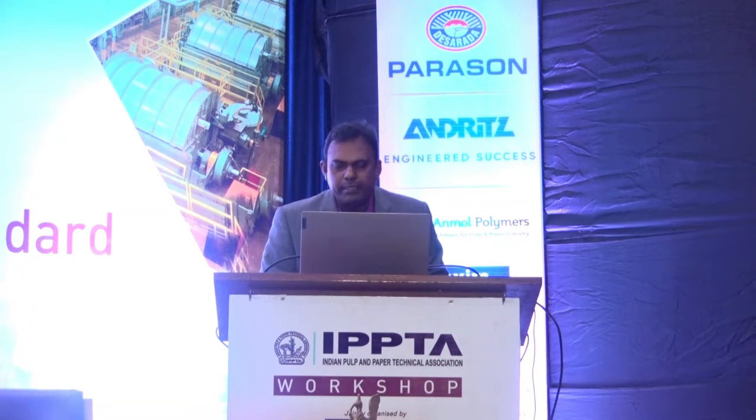Whereas wheat straw has very poor drainage properties even compared to bagasse. The loading factor will be around 1.5 to 2 tons per square meter for washing equipment. Another issue is the silica content. Bagasse and wheat straw have a higher silica content compared to hardwood, so we have to remove the silica before the cooking process. But screening and bleaching are almost similar to hardwood pulp. For screening and bleaching, we use similar equipment to what we use for hardwood pulp or softwood pulp.